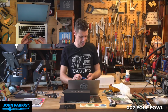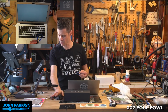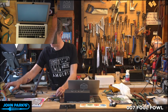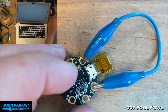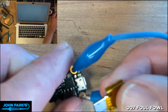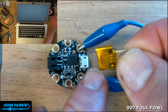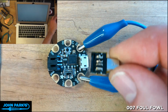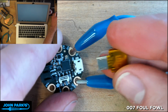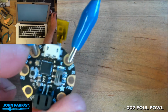Okay, now let's take a look. I was messing around with, oops, did I just turn that one off? Ooh, it didn't notice that I accidentally tried to turn it off. Thank you. Let me switch inputs for a second over to this guy. So I was playing around with these really tiny OTG, on-the-go adapters that go from micro USB to USB-A. I also put some Kapton tape on the back here because there's nothing to prevent you from plugging these in upside down, because it doesn't have a full USB housing. So I didn't want to short stuff on the inside of the USB port. But let's see, does it go in? Yeah, just like that. This would be a really tiny little package that you could plug into things.